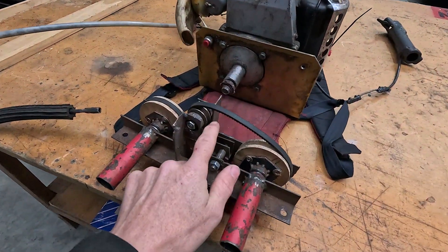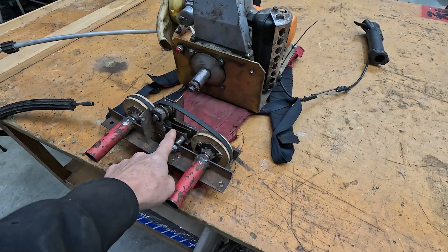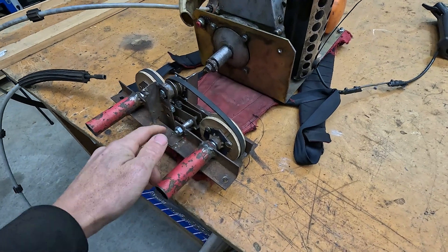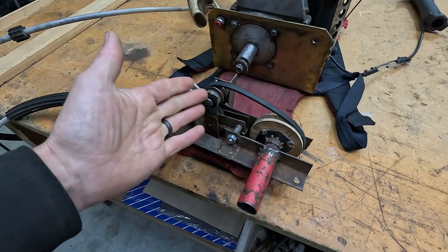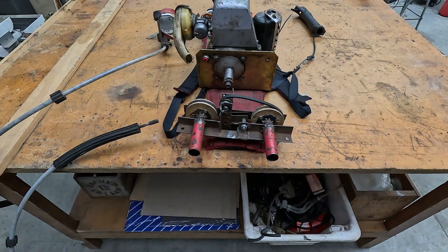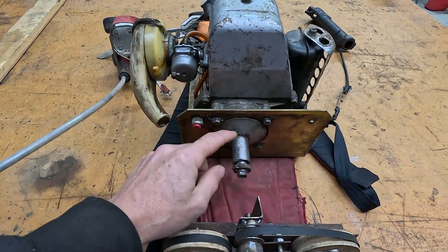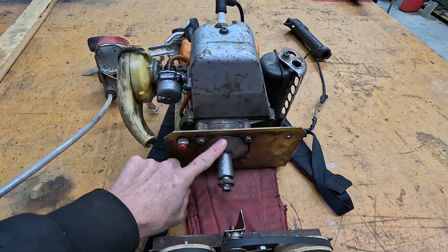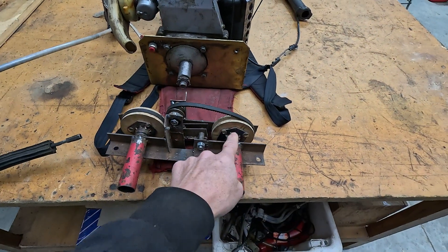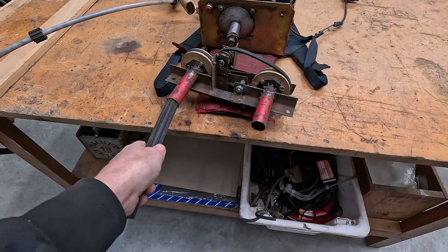So on further inspection, I have now come to the conclusion that this design prototype was actually never run. I think I just got sick of the jankiness of it. You can see I've chopped and changed and screwed and added bits just as proof of concept to see if it'll work, but I've never actually tested it. How this works is you've got your centrifugal clutch in the motor — so that spins this wheel — three to one reduction. And then the skates with that little flexi drive pop into there.